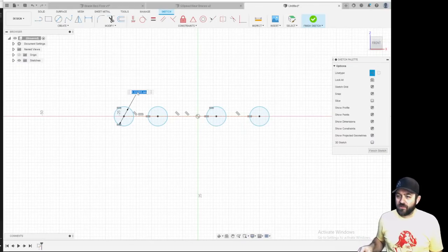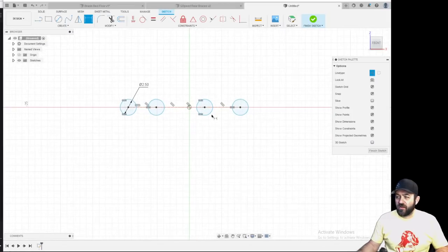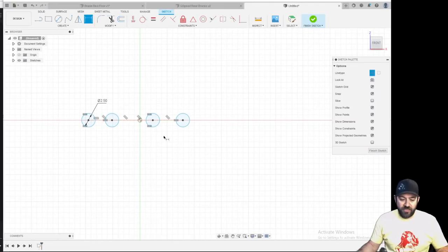So for this hole on the chassis side, it's made for a 3 millimeter hole, so probably 3.1 or a 125 drill. Since I'm going to be doing the chassis cross brace, I want it to thread in, so I'm going to use a 2.5 millimeter. And it will scale my drawing to a similar dimension, but that's okay.